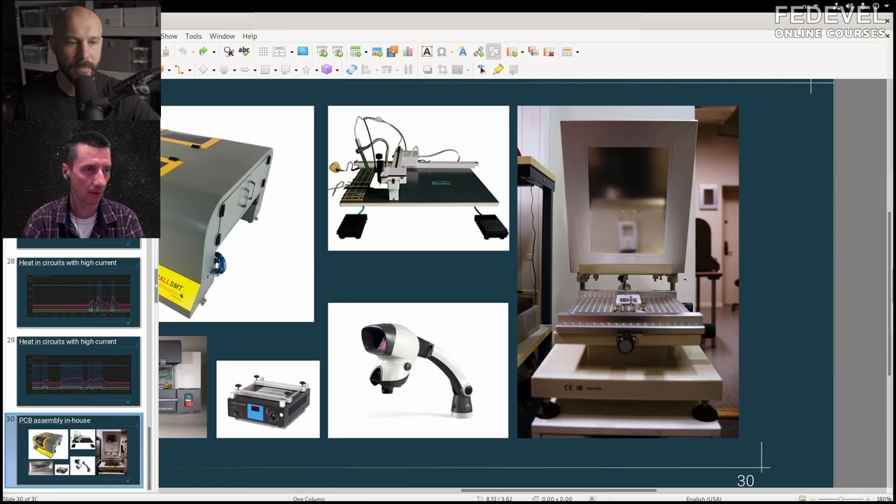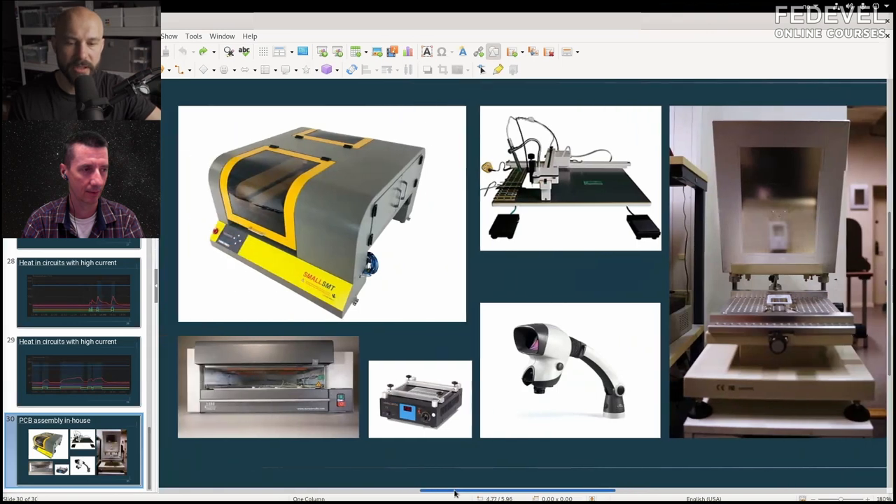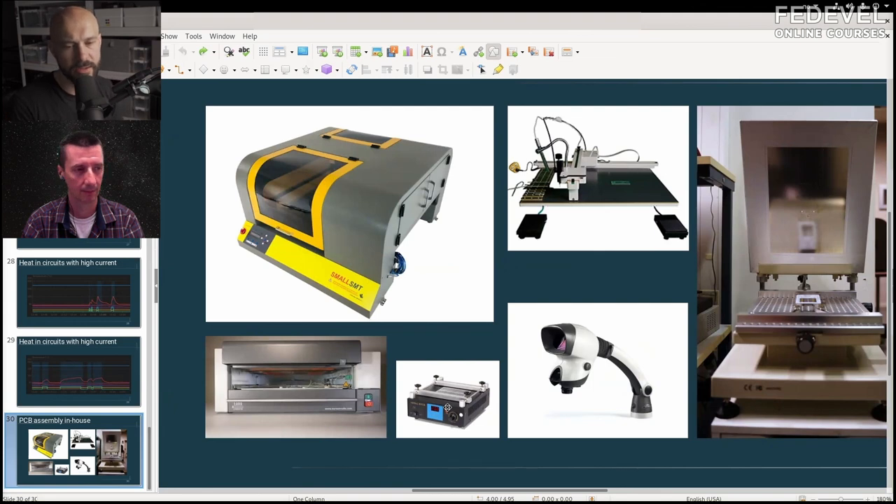There's also a Mantis microscope, and a bottom heater — a preheater — that I use to preheat the board when soldering connectors. There are large ground planes in the board, and in order to solder the through-hole connections with good wetting, it needs some preheat. I created a holder jig that holds all the components in place so I can go over with a good soldering iron.